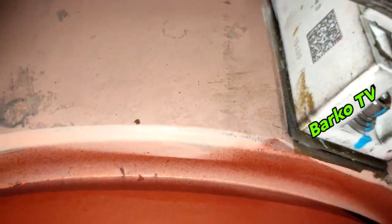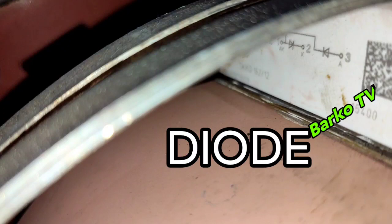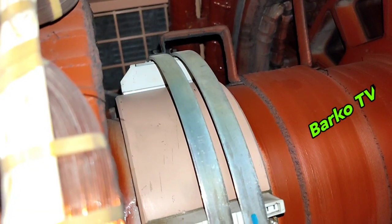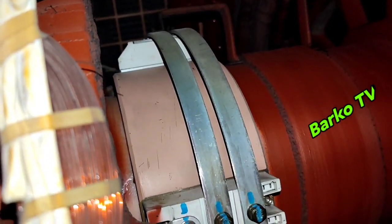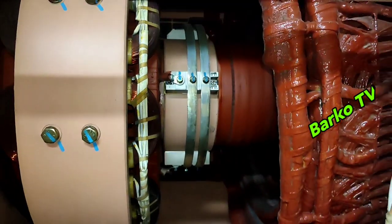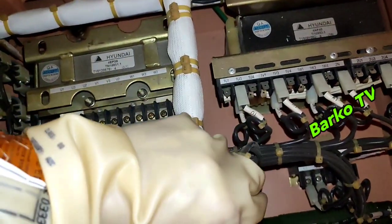Connected to the exciter rotor — that is the diode symbol. Right now we know these are the parts we need to jumper using an alligator clip, so we don't need to remove the diode and varistor. Once you jumper all units across all 5 points, it is safe to proceed with the IR test.